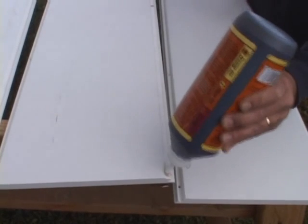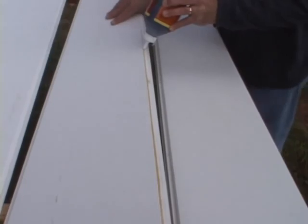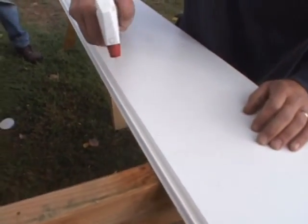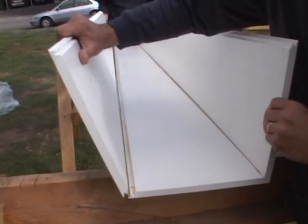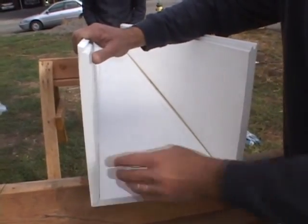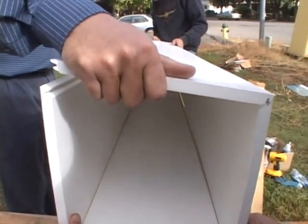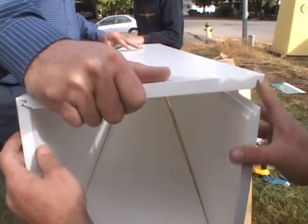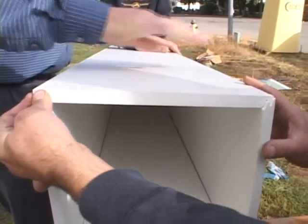Apply adhesive to the center joints. A bond and structural adhesive or polyurethane glue is recommended. Follow the manufacturer's instructions. After the application of the glue, slide the first joint together. Next, push the second joint closed. Without gluing, lay the final panel on top of the assembled column, keeping the first 2 joints square. This acts as a guide while you screw the first 3 panels together.